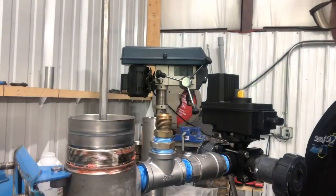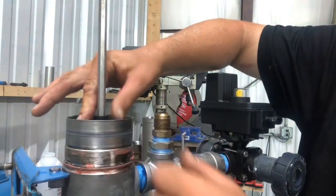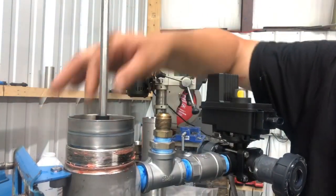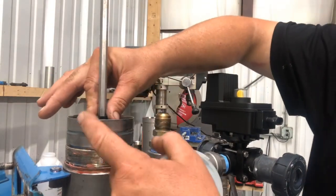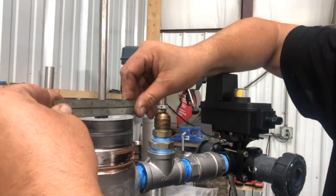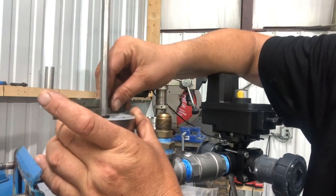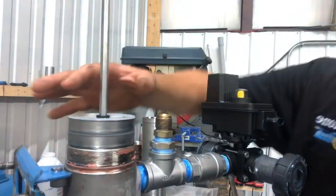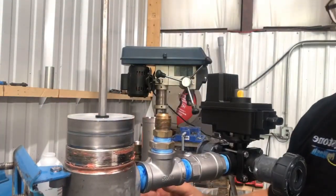Put another cup on, another impeller. Pushing down on the impeller and it's not hitting the cup. Pushing down on this — this is hitting the other shim. We've got some play. You need that for any type of debris in the water, for when it gets heated up. When this starts getting all scaled up from SH or soaps, it's got to have some tolerance. Let's slide this down on top, lock this in. Now it's hitting here — let me hold it down. We've got a slight rock. Check it again — make sure you hold this down. I've got a slight rock. So now I have this one put together.